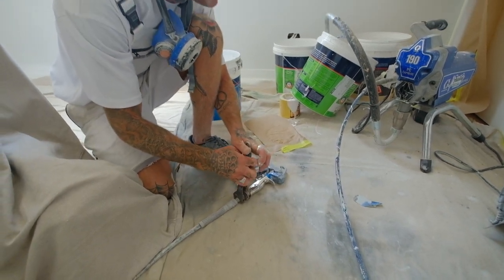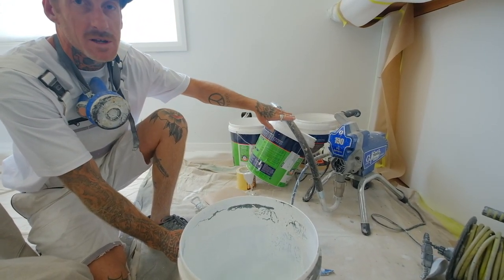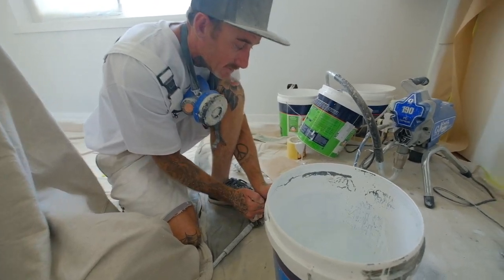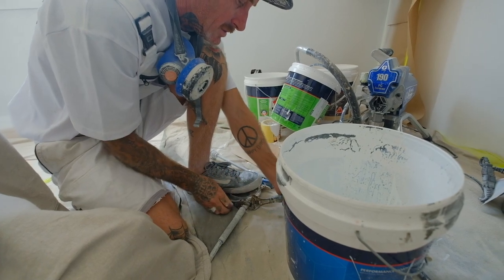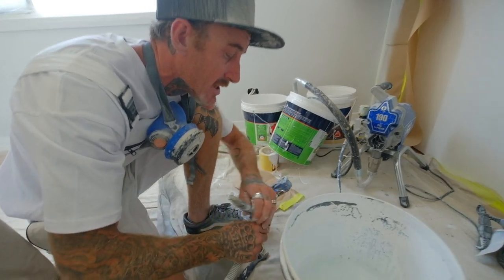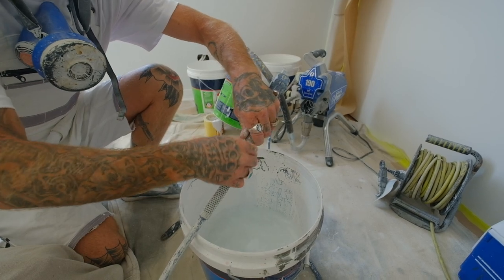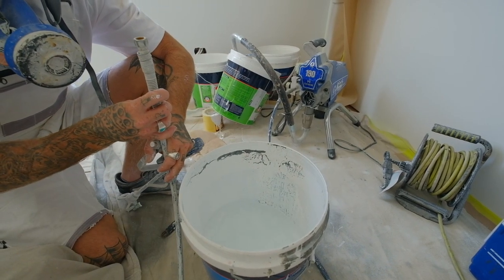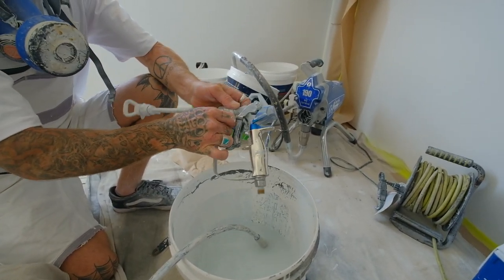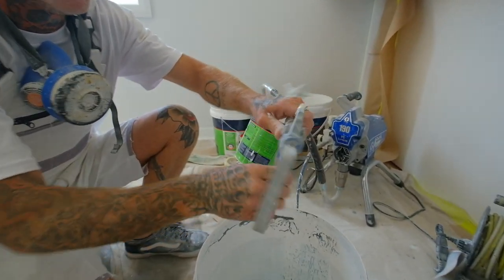First, make sure you've got a fresh drum of water, and your pressure's completely turned down and switched off. Pressure relief procedure. Right, so now, sometimes I probably put it on too tight. Sometimes when you go like this, you know what's going to happen. Whatever excess water or paint is going to come out, so try to do it over a bucket. Even though your pressure's down, sometimes you do get a bit of leakage coming through. Now it should just turn off pretty easy.